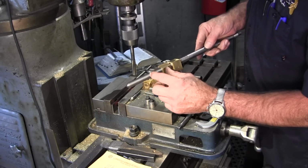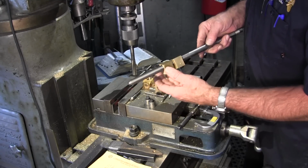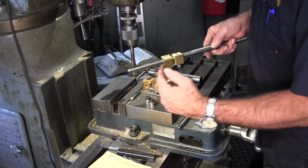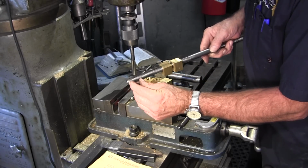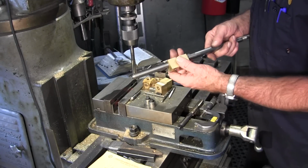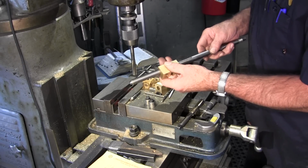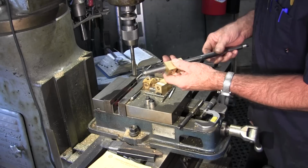We have wear. There are different amounts of play or looseness in this wear area, because it depends on whether the whole life of your machine has been used in this range right here, or down in here, or up in here. It will determine where your lathe was mostly worn out. But maybe even in the loosest area there, it's still not bad.